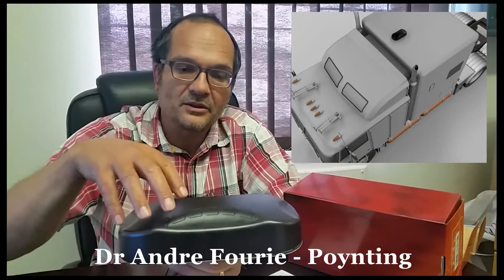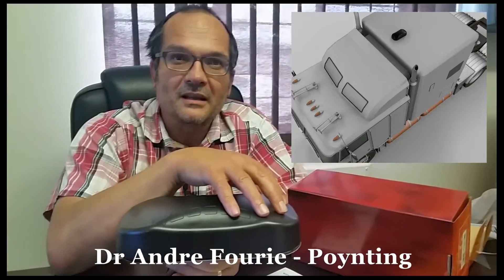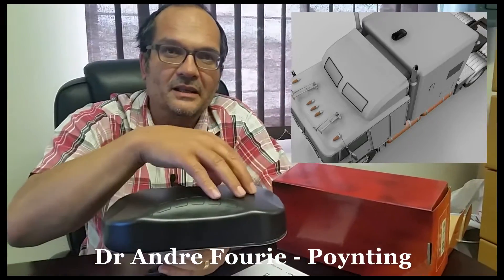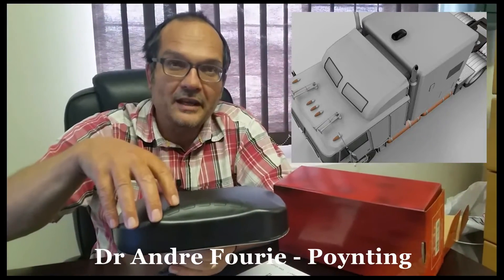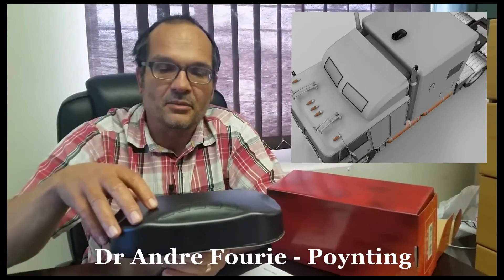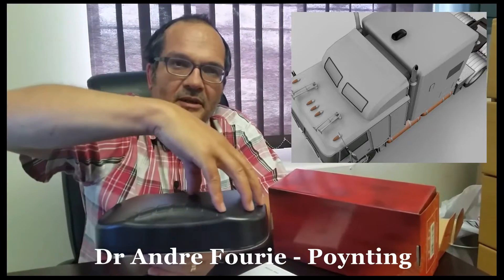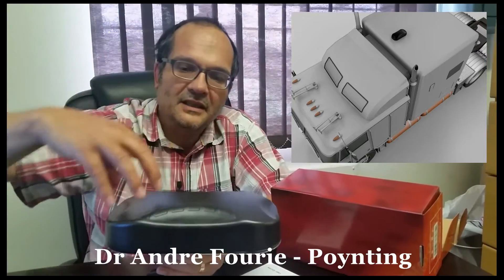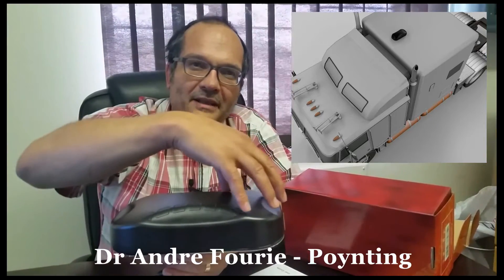It's proper MIMO of course — two antennas. What is unique is that the antennas are low gain. Remember that high gain is a swear word in omni antennas because it means the antenna is not truly omni. In this case the two antennas are fairly omni. It will never be perfectly omni with all of this inside the box, but they are also oriented so that if one is oriented like this, the other is 90 degrees out of phase. This gives you space diversity for MIMO applications but also pattern diversity.